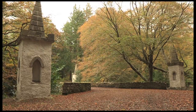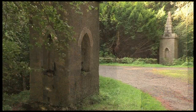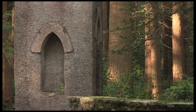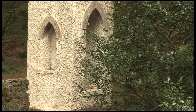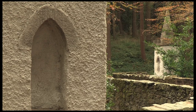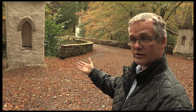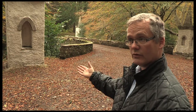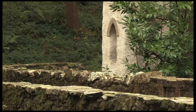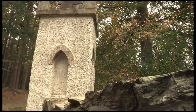This is the Abbey Bridge — one of the better bridges. What we did here was find that the four towers had remnants of a lime plaster which had almost disappeared. We applied a whisper coat to the existing towers, and the reason it's so white is because it's lime and sand — there's no cement in the mixes. This whisper coat is thrown on in a traditional manner using a spade or a coal shovel. It just brightens the towers from the rest of the bridge, and it weathers the stone slightly.